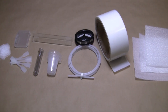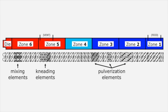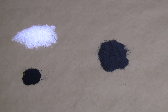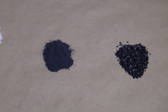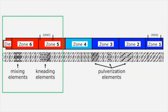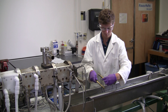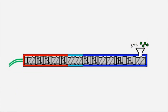Alternatively, one can explore the option of direct, subsequent processing of the extrudate into different final product forms. Inside SSME, materials undergo two different mechanisms. In the pulverization zone, significant levels of shear and compression lead to fragmentation and fusion of the polymers in the solid state. Depending on the processing parameters and the type of materials, different phenomena such as chain scission of polymers, block copolymer formation between different polymers, and exfoliation and dispersion of fillers can occur. The extrusion zone heats the pulverized materials into a melt state where rigorous kneading and intimate mixing take place. As a result, such additional phenomena as fine dispersion of blend phases and filler particles, as well as degassing, can be applied to the materials prior to exiting as an extrudate.